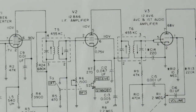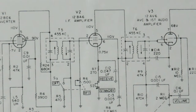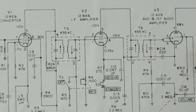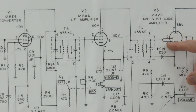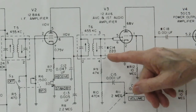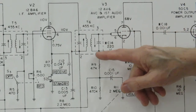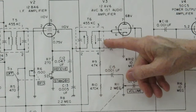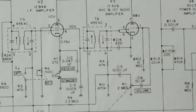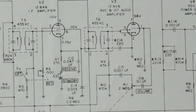And to answer your question about how you get the AGC off and how you get the audio out, that happens right here. This is basically a diode, and there's a whole loop through this capacitor and these resistors. And there's a time constant in there. That time constant is chosen such that it can handle the highest frequency incoming audio, in other words, about 5 or 10 kilohertz.